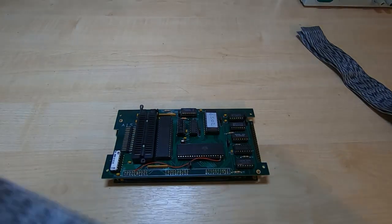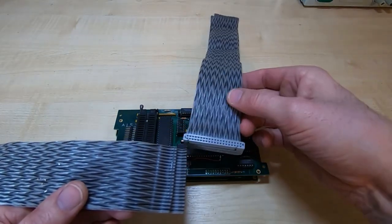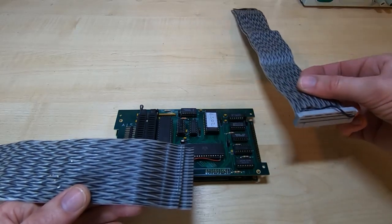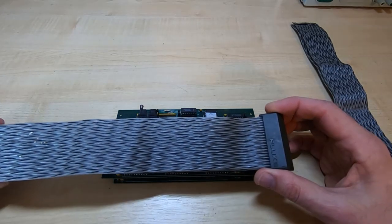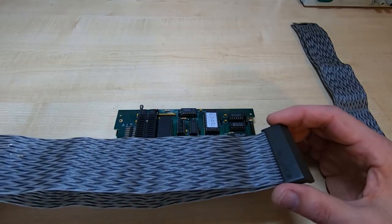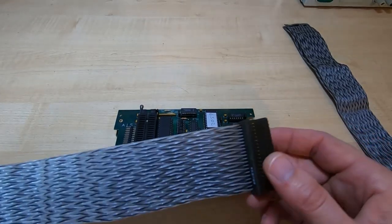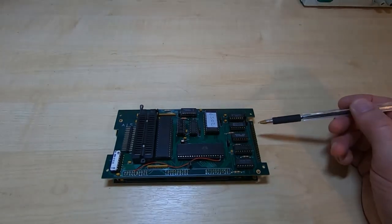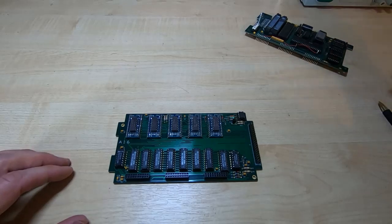So it's effectively a twisted pair for every single signal wire, with a ground lead wrapped around it. When these are made, the cable is crimped onto the pod end so that the ground wires are all connected to ground, and all the signal cables connect to the appropriate pin on the module. These are not actually as difficult to reproduce as you might first think — they essentially just join the signal pins from the pod to the appropriate pins on the UUT header. Fluke, being extremely good at what they do, took a very sensible approach and laid out the pins on the connector in such a way that all the connections are in a sensible order.